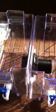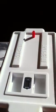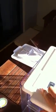A lot of DIY ionizers suggest that you use titanium as electrodes. I wasn't able to source titanium strips easily, so what I've done on the inside of the lids, that's a picture of my lid. If you were to lift it up, this is the electrode. It's a stainless steel strip, and I actually just modified it. It's a stainless steel cable tie that I have cut and drilled.